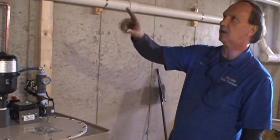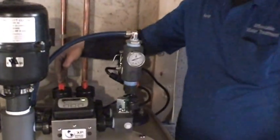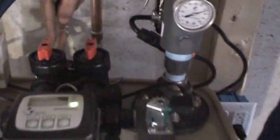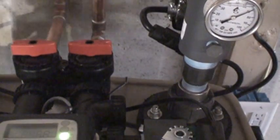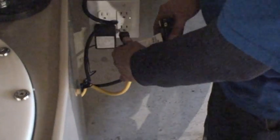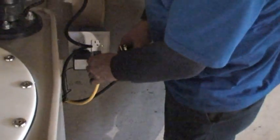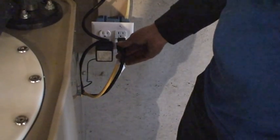In case of emergency, if you didn't want to mess with the main bypass, there are two valves on the back — one's pointing in, one's pointing out. All you do is just turn them toward each other and now the unit's bypassed. If you want to get it to stop running, just unplug the two big cords — the yellow and the black. The yellow cord runs the blower and the solenoid, which is engaged when it's filling. The other one runs the actual submersible pump in the tank.